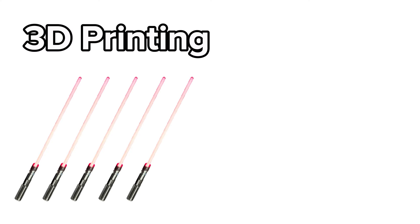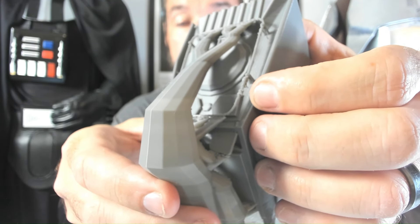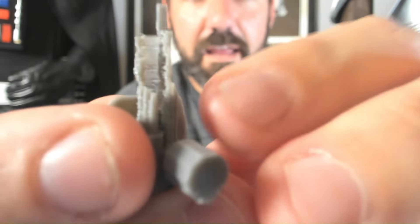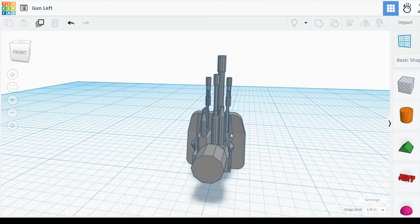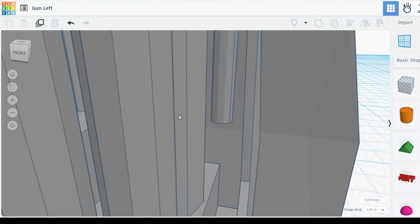For the printing I rated a 5 out of 10. Let me show you the biggest issues I ran into. On the head you can see the rails — they are very thin and as this piece gets longer without support, the part starts to move and bend slightly when the printhead goes across it. You can slow the printer down to help with this issue but I'll get back to this part later. The left gun was the most difficult to print. There's plenty of stringing and all these little skinny pieces going straight up — this is better for a resin printer. There was also an issue with the file: this gun is not attached to anything and is just floating there, so I modified the file by adding a cylinder to support it.